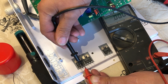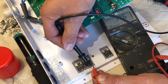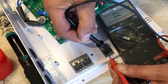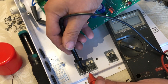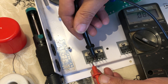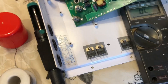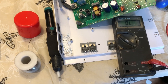That diode is definitely broken. Those other diodes are good. So it's definitely this one — this is the fault. Well, this is one of the faults we've found. There could be more, but this looks like the problem. So what I think we're going to do now is track down a diode to try and replace it — we'll see if we can find a diode.